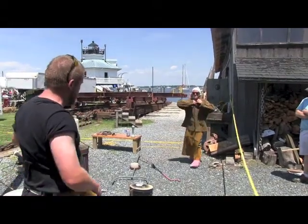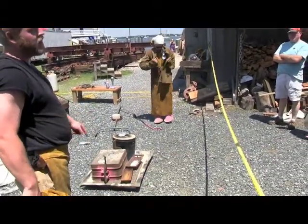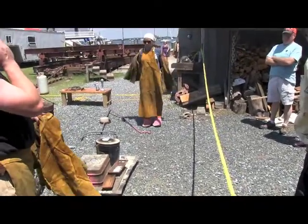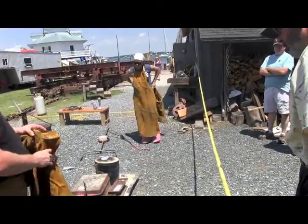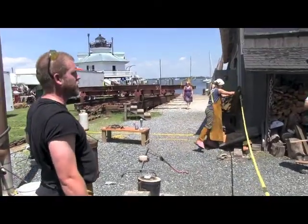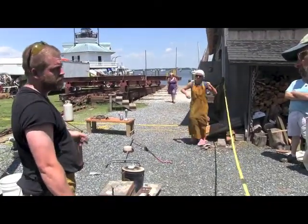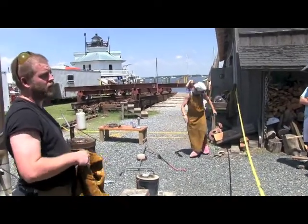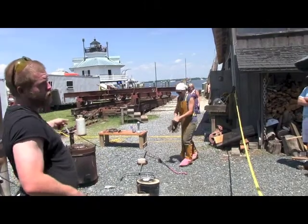And that's it. This little mold that's here is called an ingot. That's what we put the excess metal in, like I was saying. A lot of oversplash on that one, but we can pick all that up and remelt it. If you're melting multiple pots, you can pick that stuff up and drop it right back in the furnace, and it melts much quicker because it's already 700 degrees. Make sure you're using tongs to pick up hot metal, not gloves. Really, you should use tongs to charge with.